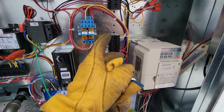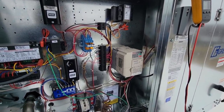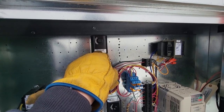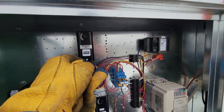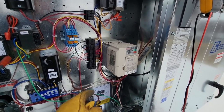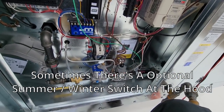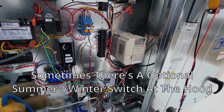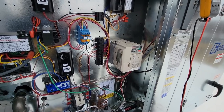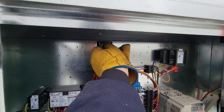What I ended up doing is telling it to stop running and wanted to see if it would make a difference. I jumped R to W1. The way this works — down below it tells it when this thing needs to run. You have the heating inlet air — anytime it gets below 60 degrees or whatever you set it at, it will allow the heat to run as long as the fans are running. The fans downstairs were told to stop, so it stopped this unit. With my jumper, it's going to have its call for heat.